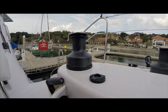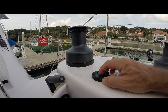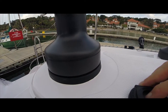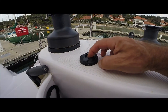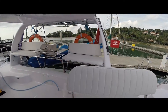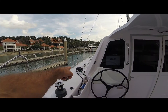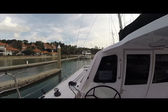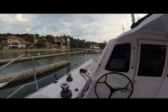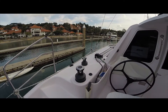Of course if you want to go electric instead of manual, you can. Pretty sweet. Should make raising the main a lot easier when you're by yourself. The issue isn't that the main is that heavy - you can actually pull it up if you stand out at the mast by yourself. The issue is tailing, because it's going through so many turning blocks. So if you're at the mast, because it's two to one, it's really easy to pull the main up, but then you need someone down here to tail it for you. So if you're by yourself, you can't do that - that's why I've gone for the electric winch.